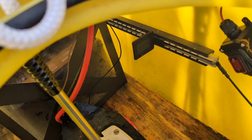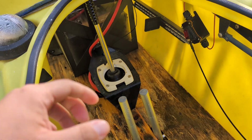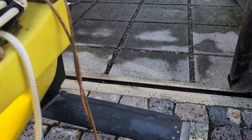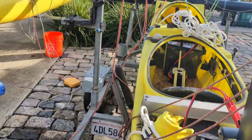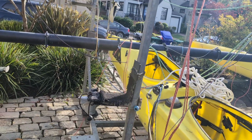We can turn on the electric bilge right here, but the boat's dry enough inside right now that you can't pump any water out. But there's a secondary hand bilge right here. This is because there's two different access points to the bilge pump, so that I can pump out the water no matter how we're pitched. And that's it for the components we can see right here. I will give you more when I put the mast up.